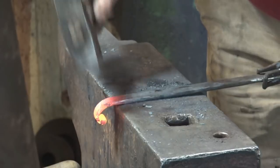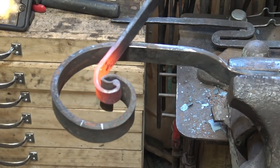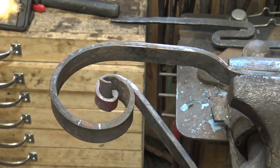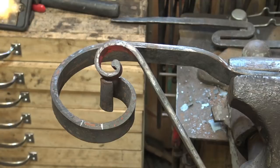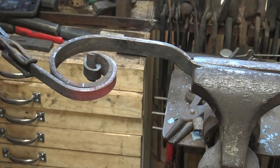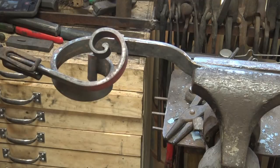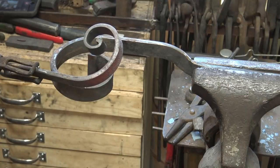We'll start scrolling by hand and by eye at the anvil. Then it makes a nice place to hook into the scroll form. We'll lower it down in the scroll form as we go around. We'll need another little heat there but that's coming out very nicely. We'll put that back in the scroll jig and pull it around just a little bit more. That's a good sample of how that scroll can look. I think I'm going to do a little filing — I see a little pointy spot on the end of the snub, so I'll get in there with a small file and clean that up. Would have been better to do before I scrolled it.